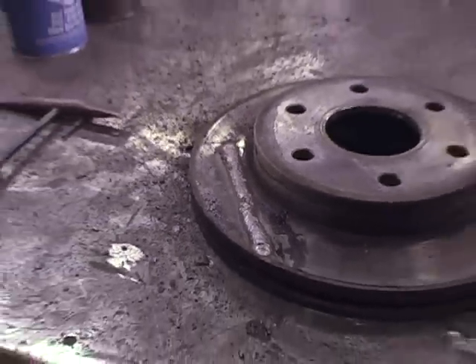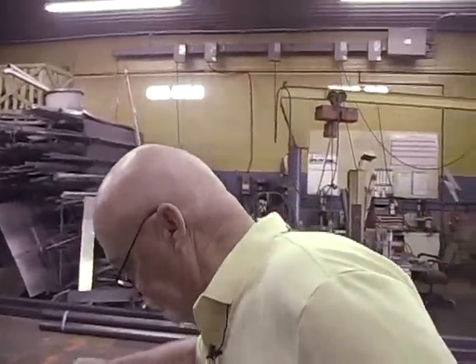Does this work out of position, say vertical down? Tom's going to attempt to go vertical down with this because sometimes you've got a bulldozer motor casing under a truck or under a bulldozer and you're laying there with oil all over and you can't put things into position — maybe a machine base or an electric motor base that's too big to move. So we're going to try to weld it vertical down. NastiCast — weld cast iron out of position through dirt and grease and oil and everything you can think of.